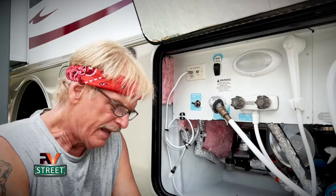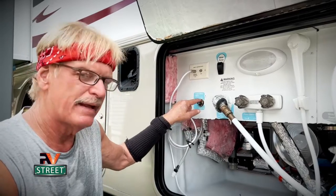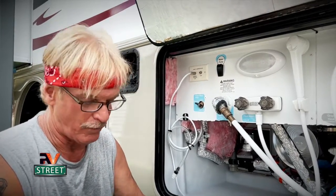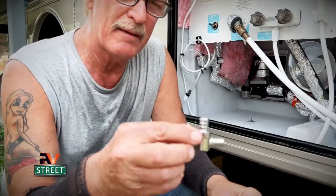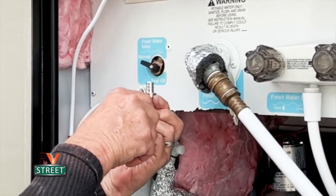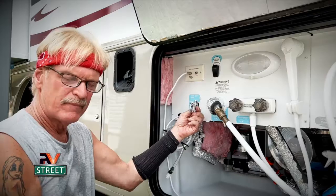It's no big deal. Since it's not the pump but this valve, the answer is to replace it. This is the factory valve and it's brass. I could not find an exact replacement and had to do quite a bit of hunting, but this is the one I found. It's the same exact kind of valve but it's stainless and only a quarter turn. When I want normal mode I turn it this way, and when I want tank fill it'll be that way. It's a quarter turn half-inch PEX diverter valve, also called a quarter turn valve.